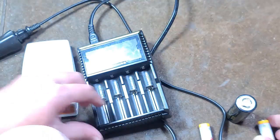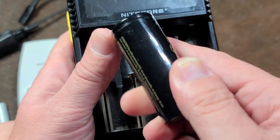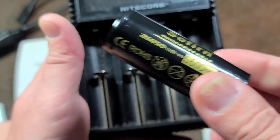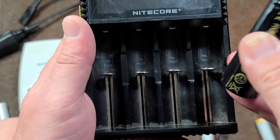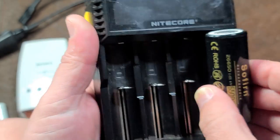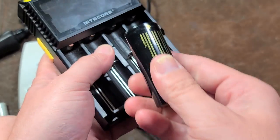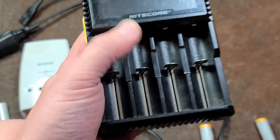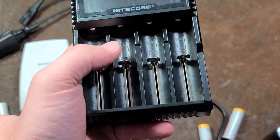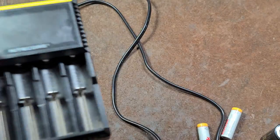The other annoying thing is the fact that it does technically work — I just showed it works with a 26650, which is an awesome cell, like this 5,500 milliamp-hour one. This is like a 20 watt-hour battery — pretty incredible. The thing is, it's really designed for 18650s, so if I put one of these on the side, it tilts it up and doesn't make contact. It also means I can't run two 26650s side by side; you can stuff one in there, but only one at a time. It's kind of false advertising that it's 26650 compatible, because you can only charge one at a time in a four-bay charger since the two side bays don't have enough space for this battery diameter. But I will keep it for regular 18650s — that will be handy.